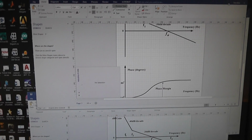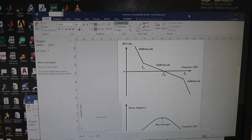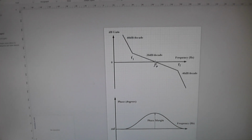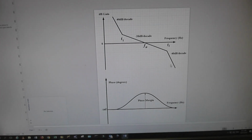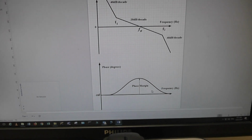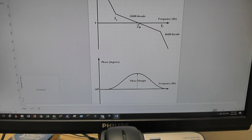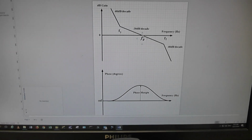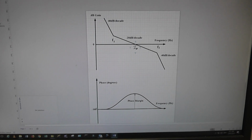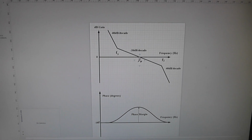But again, in practice, we don't do that because we want to roll off at high frequencies. So we normally do something like this. So -40, -20 through unity gain, and then -40. And we get this really nice phase advance, sort of goes to a maximum and then a minimum. You've got to get the gain right here so that it crosses over at, let's say, 100 Hertz. If you don't, then you'll easily notice the phase margin problem because it starts to oscillate or overshoot and so on. Okay,